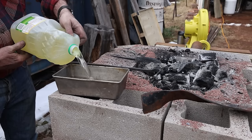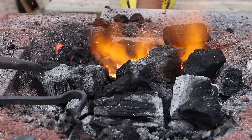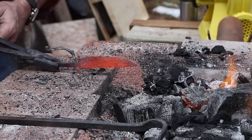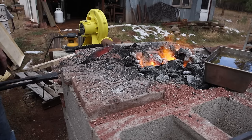Right now I've got it sitting next to the fire while the blade normalizes so I can preheat the oil a little bit. Warm oil is better than cold oil. The blade was brought up to a dull red and I'm going to let it air cool — I'm going to do that three times to normalize it and de-stress it. That greatly reduces the odds that it's going to warp when we quench it.